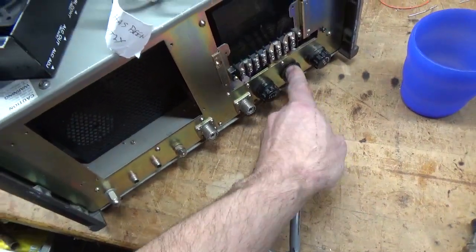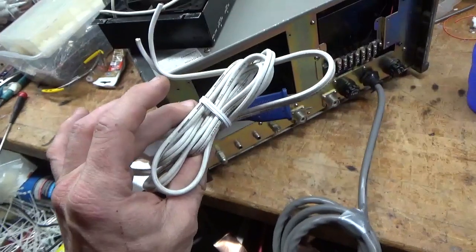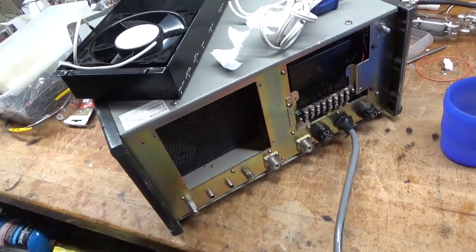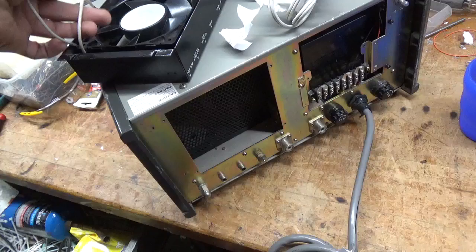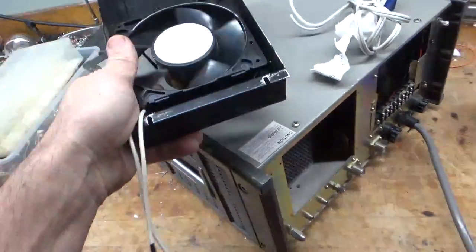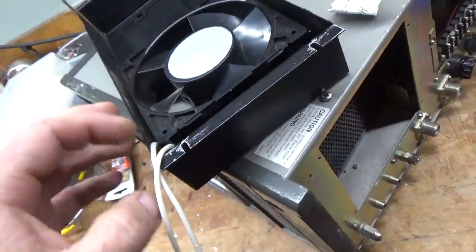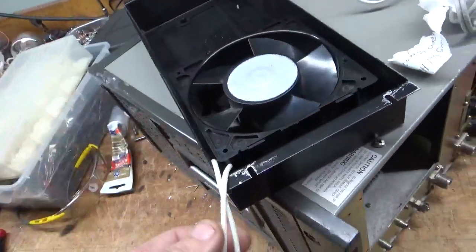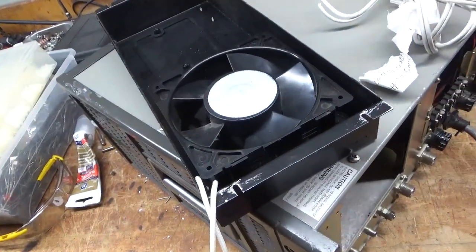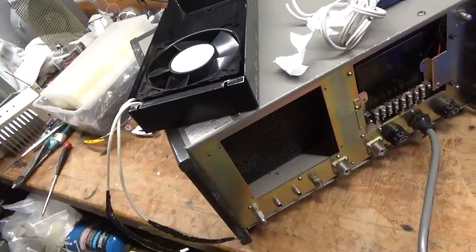The nut is loose and the strain relief. Something I've never seen before — it actually had a second power cord that ran the fan. I already opened it up and saw where they disconnected it from the delay-off fan circuit. I don't know why they did that; I've never seen that before. It's a stock fan. I can see where the wires are soldered and there's no protection on the wires where they're soldered to the fan. So I'll have to take this off, re-solder these wires, and put heat shrink on them so they don't short at the fan connection.